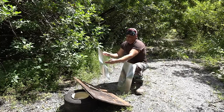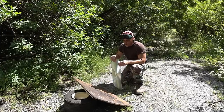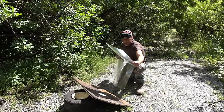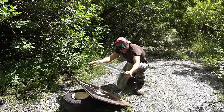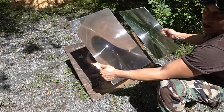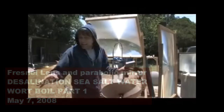Another common myth is arraying a bunch of lenses together. If this lens were cut into four pieces, you'd have four quarter sections that all go to a common focal point. But when you take one lens and a second separate lens and attempt to get them to focus on the same spot, it doesn't matter how you turn the lenses or which direction — they're both going to have two completely different focal points. No matter how I turn them, light will not travel in a curved direction; it always travels in a straight line.